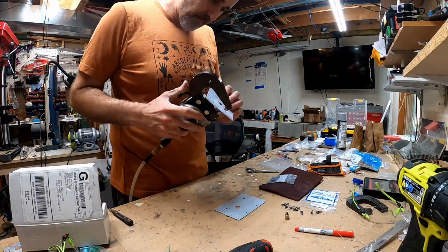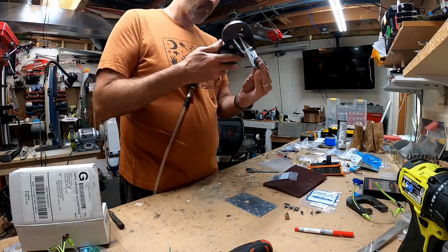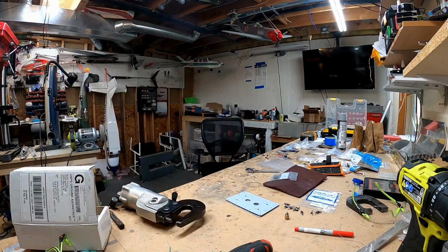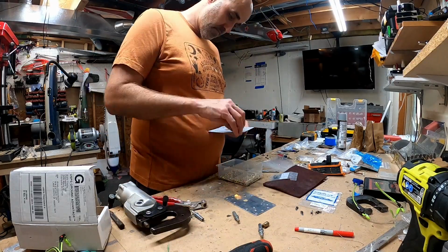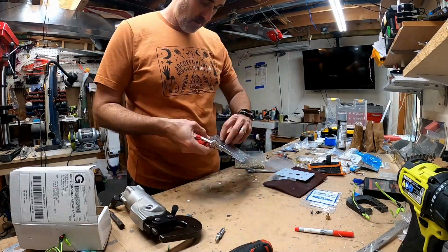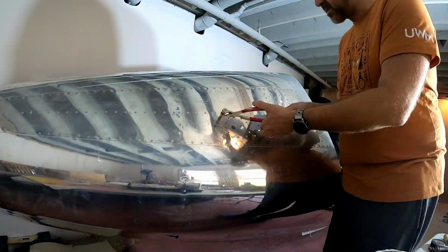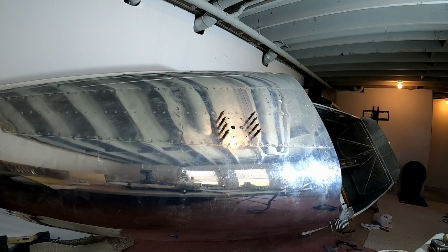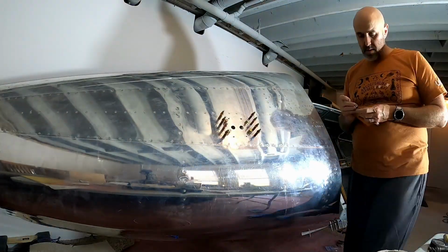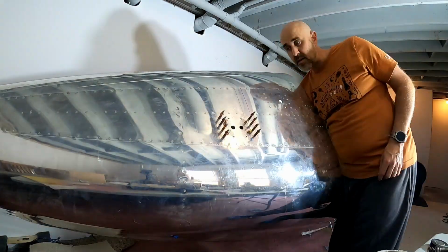Yes, they are primed. No, they don't need to have a proper ground plane connection. Technically, these GPS antennas don't need it, so you can prime both sides. Even so, your rivets are going to technically create a ground plane connection between the skin of the airplane and the nut plates and all that. So it's going to have one anyway, but this is an exterior facing thing. It's going to have caulk around it to seal the antenna once it's fully installed, but let's just do it right.